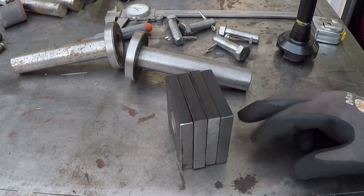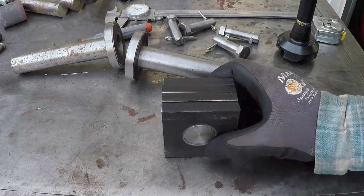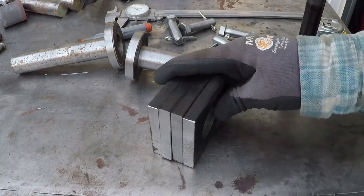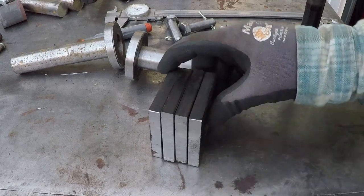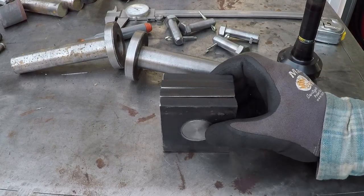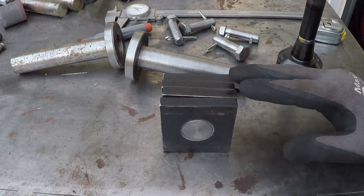Now all the holes are aligned, and I could chuck this on the mill, and then I use this cutter and square all four sides. Once I finish, the bottom side, the one that's gonna be away from the tailgate, I'm going to cut 45 on both sides to make it look better, and if somebody accidentally runs their hand against it, it won't hurt as bad.